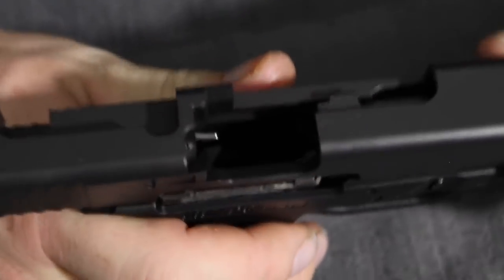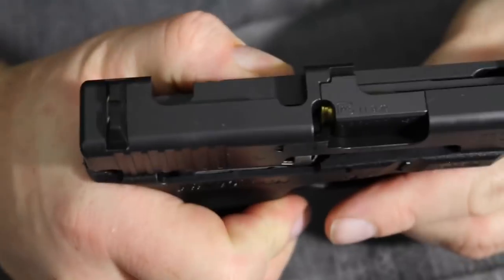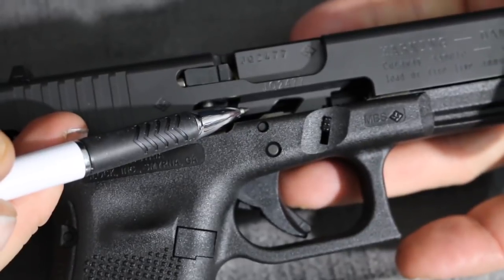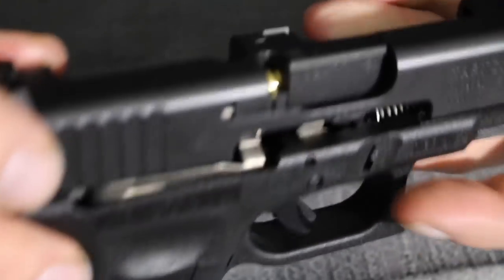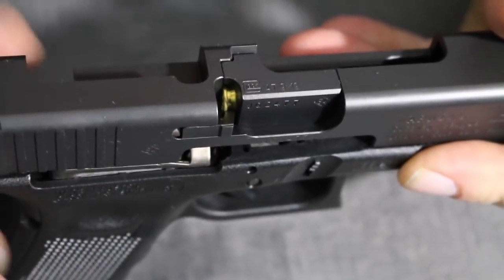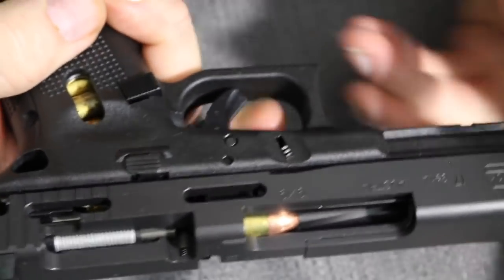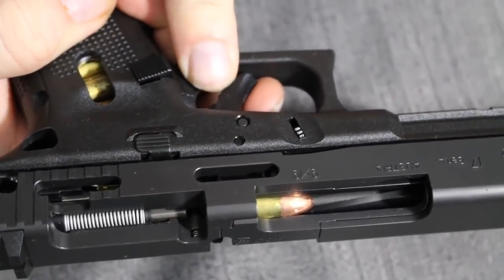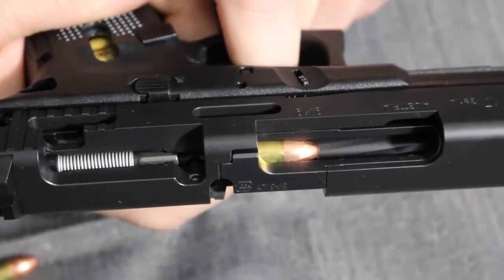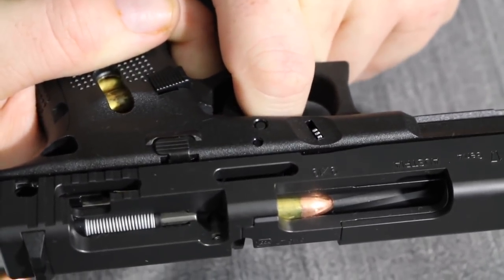So we're able to see this one more time. Insert. Load. Again, we see our extractor engaged on the rim. We see that our barrel is now in the lock position, fully forward — engaged in the front and in the rear of the barrel hood. So now we're in the lock position. As we pull the trigger, first we're going to release the trigger safety — you can see that rotate out of the way. And as we pull back the trigger, we can see the striker is being pulled rearward. Now we can see the firing pin block rising to get out of the way.